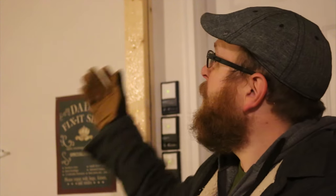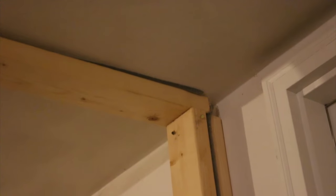So now at the other end of this 12-foot board, the sill plate, I'm going to put another one, and I'm going to run the top plate all the way down and make a real shoddy arrangement until I can get all of the other studs in the middle. But once I get the two ends up and get that top plate on, everything else should pop right into place. Okay, so there's the inside corner with the foam between the ceiling and the top plate.